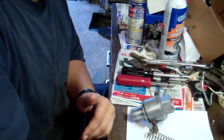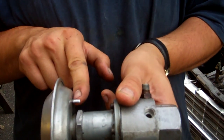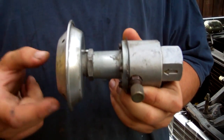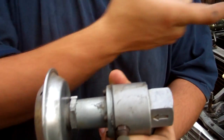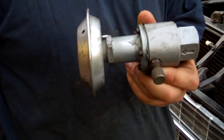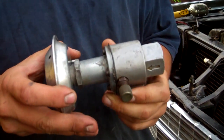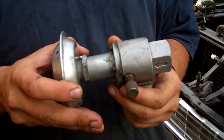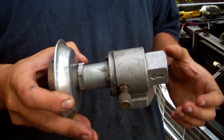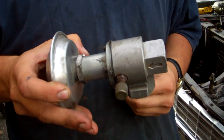When you want to override the dial and have warmer air coming out of the vents, vacuum gets applied to this nipple. The vacuum diaphragm has a rod attached to it - the rod puts additional pressure on the piston, which raises the pressure in the evaporator above 30 PSI, giving you warmer air out of the dash vents. Higher pressure equates to higher temperature refrigerant - it's all in pressure, not in quantity.